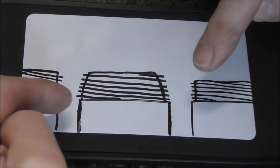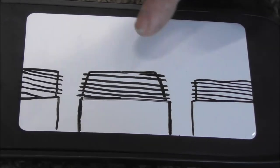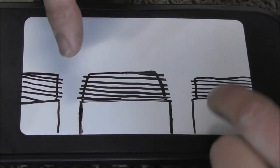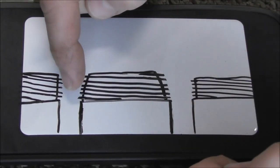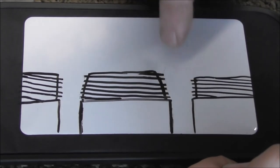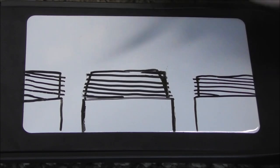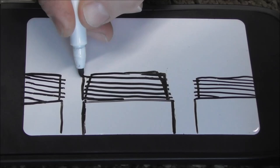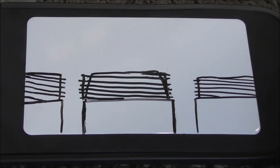Here's a drawing of what it looks like. You can see that the walls are tapered inward, so when you put the cap on it doesn't have a lot to hold on to. The threads on the outside are also a little worn down. What needs to be done is to straighten out the walls of the casing so that it is cylindrical again and gives the valve cap something to hold on to.